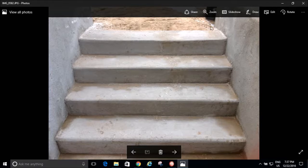And later, like I say in my other video, I'm going to add on, from here all the way out to the alley. You can't see it, but from here all the way out to the alley, I've calculated a 1/4 inch slope per foot. So when I bring my muddy vehicles into the garage, I could just hose them off. All that water is going to run right down to the alley. And when we go to sweep our floor, we can wet sweep it, and it will all run down that way. So that's another reason I had to build this up so high.